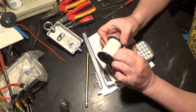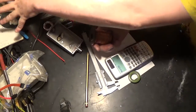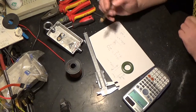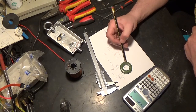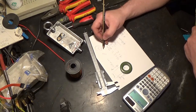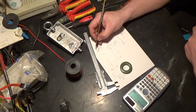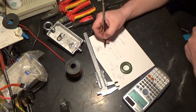And then after we've measured out each 760 mil, we need 2 of them, because with this design, what's going to be wound around this ferrite core is 2 pieces of copper wire in parallel next to each other, and they're going to go around 7 turns here, 7 turns there. So you're going to have effectively a toroid with 2 wires coming in, both winding their way around. It's going to go across like that, come around there, and then you're going to have the 2 wires coming off. So that one, that one, that one, and that one.